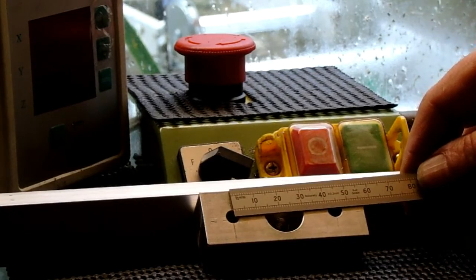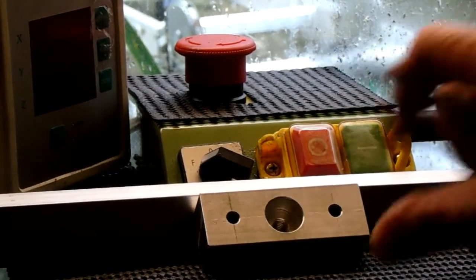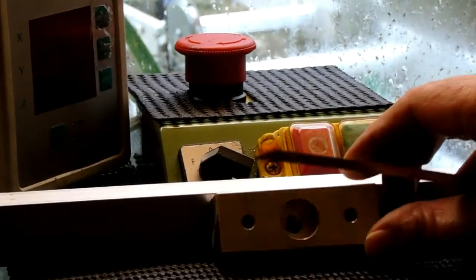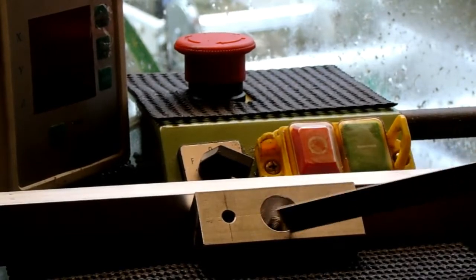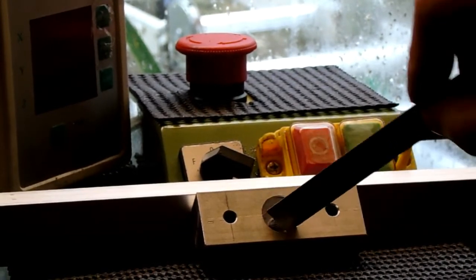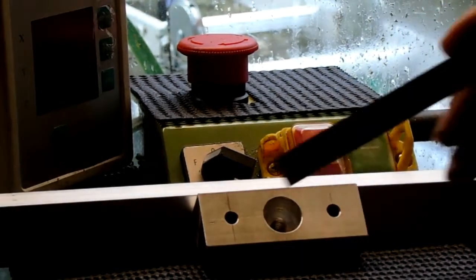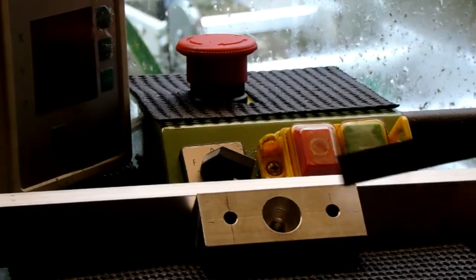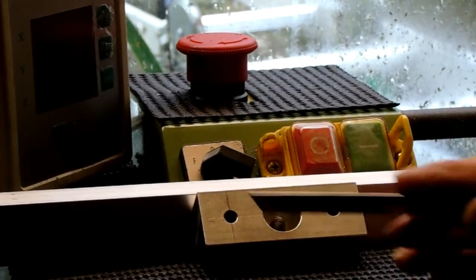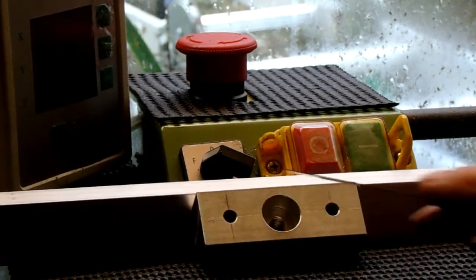Basically you have 2 5 millimeter holes, one either end, an M8 thread right through in the center, and a counterbore hole 16 mm in diameter, set to quite a critical depth, and then machined out, tapped and what have you, and cut to length. The only things that are critical really is the depth of this step, and obviously the position of the 3 holes. I mean, the center line about from the center.